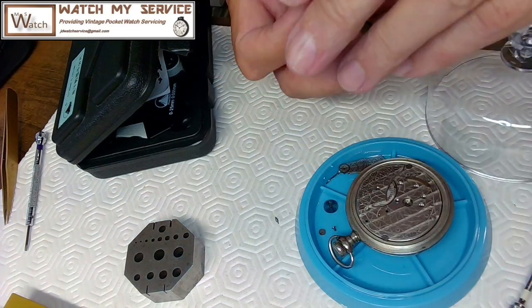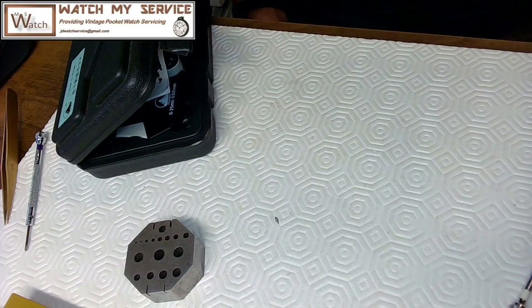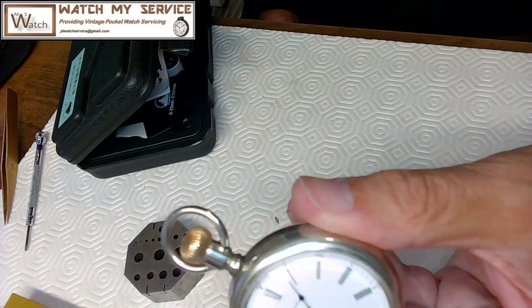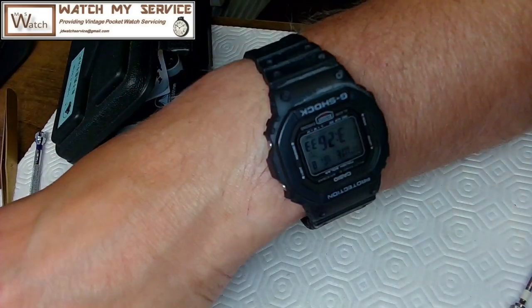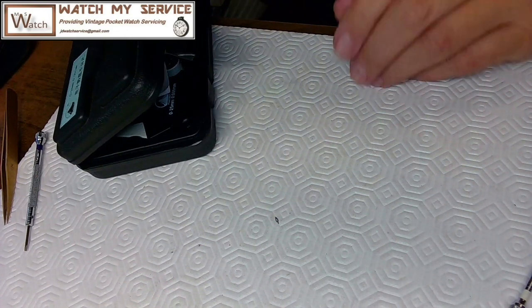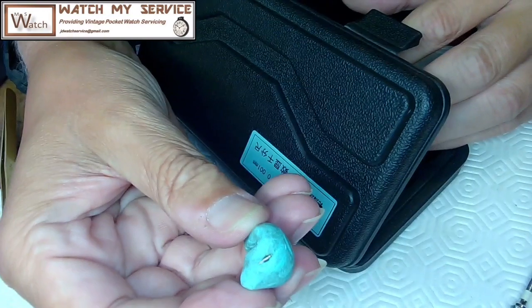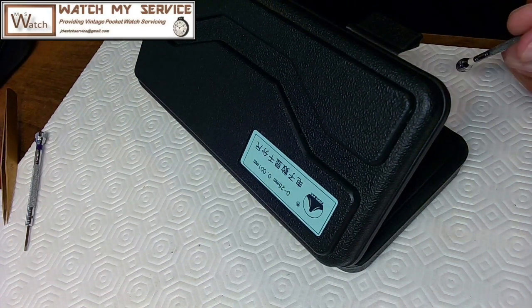I'll put the rest of the watch away in the tray so it's safe. The other Waltham watch has taken a licking and is still ticking — that's pretty impressive. That's the one that just needs cleaning. Cleaning up your tools is absolutely essential, otherwise you might set something down on the balance staff and never find it again. As any watchmaker will agree, your arm is a magnet for watch parts. I'm going to embed this little balance staff in a piece of Rodico so I won't lose it.